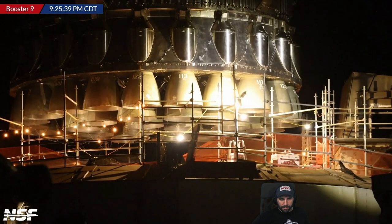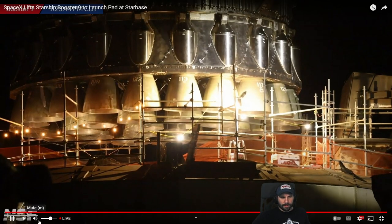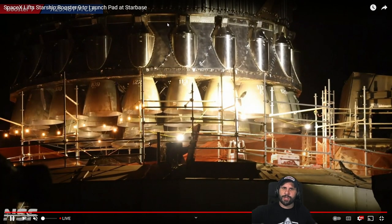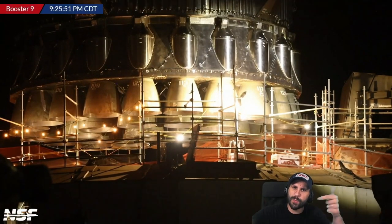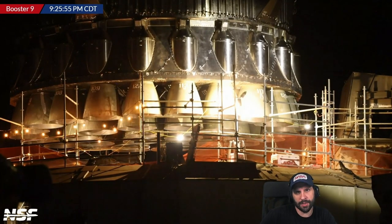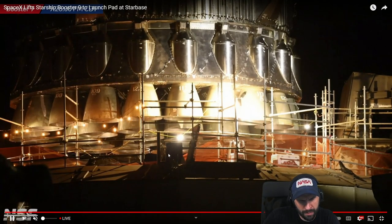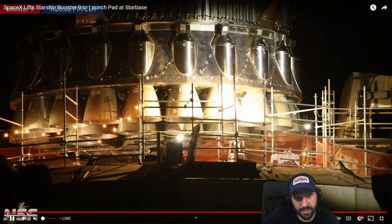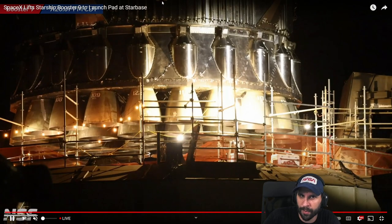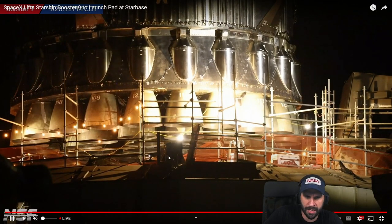Yeah, you know, SpaceX has their hands full. So, basically what they're going to do, guys, you saw the transport stand. The transport stand had those pins that locate the booster and align it for all the other hold-down points. There's another set of those on the OLM. It's right there, see it? I don't honestly remember if this thing lifts up, but when they lower the booster down, you're going to see a pilot hole right here. It's literally just a structural alignment pin.